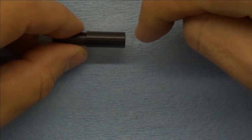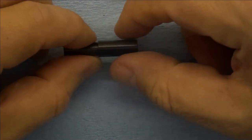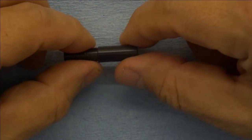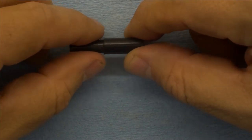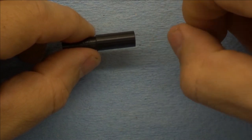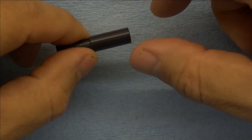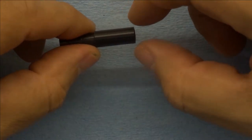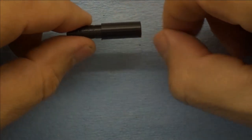You might have noticed, as I was making this, I wound up shortening the shank quite a bit. The measurement that I originally had that I got by probing the inside of the mortise was actually including the Savinelli filter. So the filter is obviously going to be a bit more narrow than the tenon, and that's why I had hit that ledge rather than the ledge where the tenon is supposed to stop.